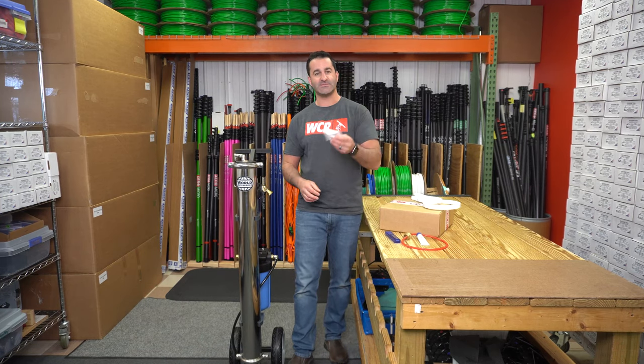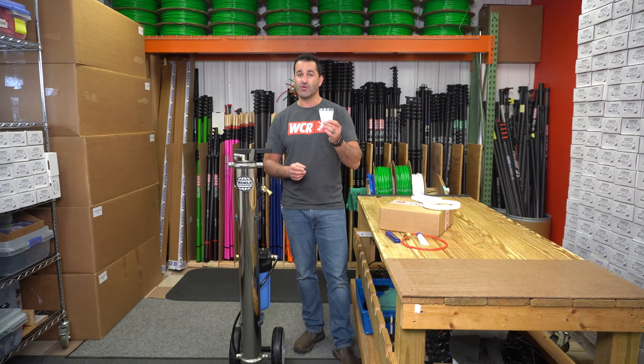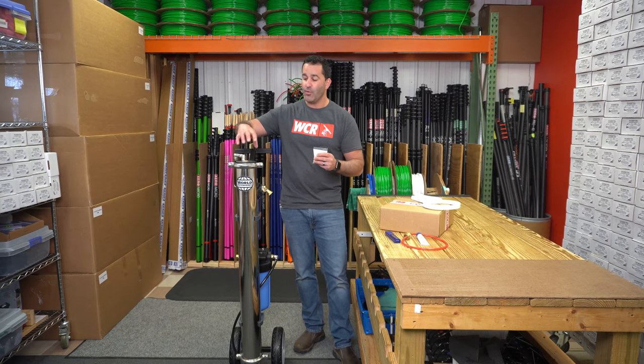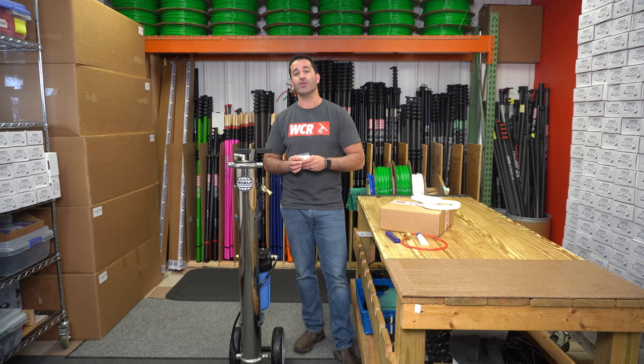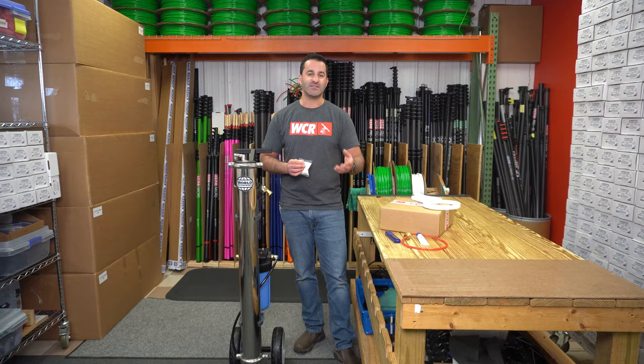And lastly, a small bag of RO Guardian. RO Guardian is something that you're going to mix with a gallon of water or RV antifreeze and pour directly onto the RO membrane when you're ready to store your World 1 for either winter or an extended period of time, typically over 6 weeks or so.